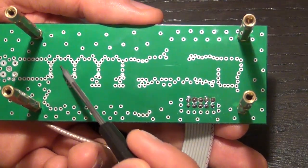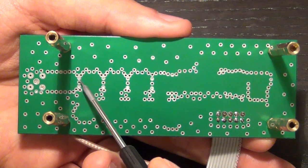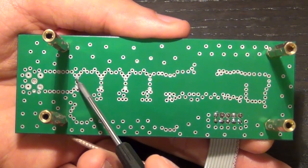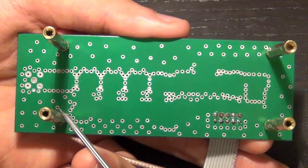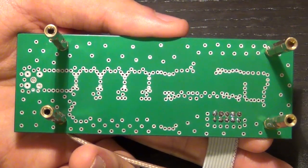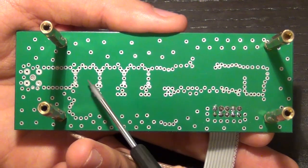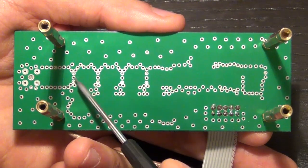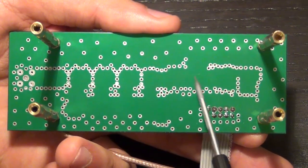And again, you can see the stitching very carefully, that the stitching surrounds a microstrip transmission line like so, and whenever there is a microwave component or wherever there is an amplifier, you bring the ground right there very close to the microwave component and making sure that the ground connection to that component is really well connected both to the top and the bottom of the board, making sure that there is no resonances and no impedance variations on the ground, because you definitely don't want that. And in between the amplifier stages, we have a solid ground where the transmission line will run over.